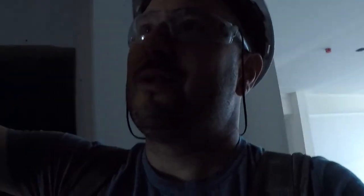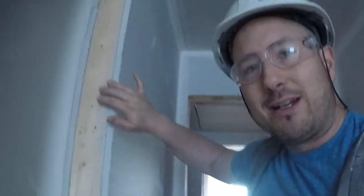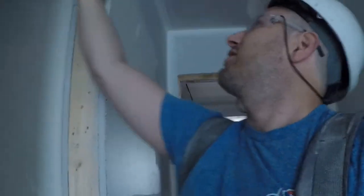The first thing to learn about proper returns is when you're drywalling, you don't want the drywall to come past the framing. See like here? I'm going to end up trimming this back before I put the actual return on. You want to stop it — a corner bead is best when you leave a quarter inch on either side for the mud and the bead to go on properly.